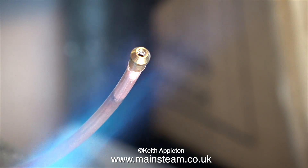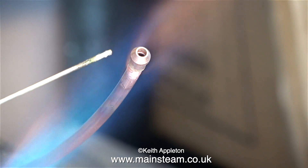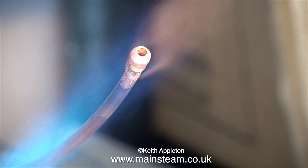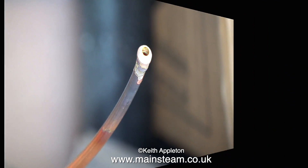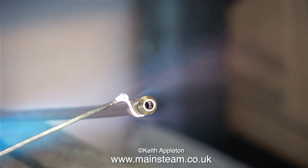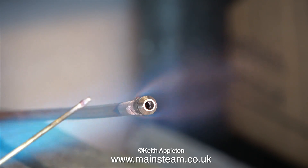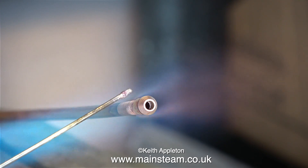You can clearly see the silver solder flux flowing into the work between the union cone and the pipe. I apply some silver solder as soon as it reaches red heat — you don't want to cremate the part. You can clearly see how the molten silver solder flashes around the joint. For the other end, by way of demonstration I went in too quickly with full heat and you can see it moved the flux around — I put it back in position before continuing heating.